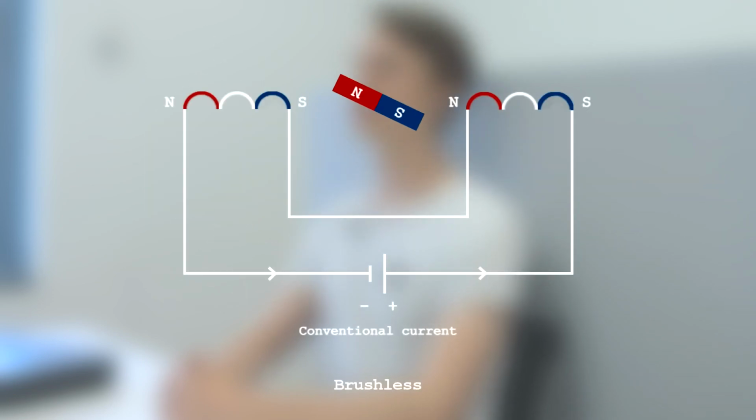The brushless DC motor is quite similar to the brushed version, but lacks the brushes and has the magnets and winding swapped. The rotor is connected to the magnets and thus no physical contact is required. The advantages of the brushless DC motor are higher efficiencies, high reliability, better control, and most importantly, no wear out. However, they are much more expensive.